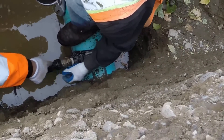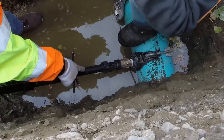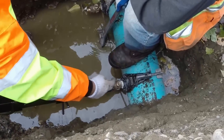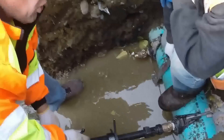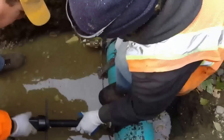A lot of times if you don't use your measuring here — start off with zero. If you start off on two or three and forget, you won't make it back out. You'll make the tap but your bit will still be in here, and you'll be in a lot of trouble. You'll have to shut down the main line, and that's not good. So we should be able to pull this out and get a little bit of water.